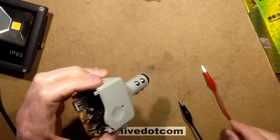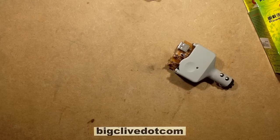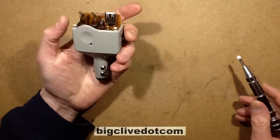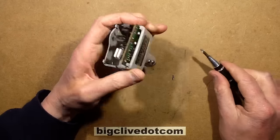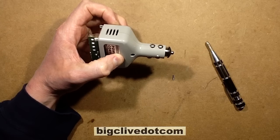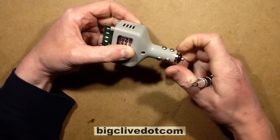So let's take a wee look inside. Let's short-circuit it out first — just bridge that just in case it holds a charge — and we'll take a look at the circuitry. The transformer in it is tiny, so it really is probably only going to be rated — well, it went up to 200mA there at 12 volts, which is really only just a few watts. It's probably only really suited to a charger in the range of about maybe 500mA at 5 volts.